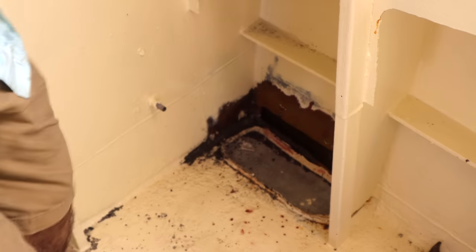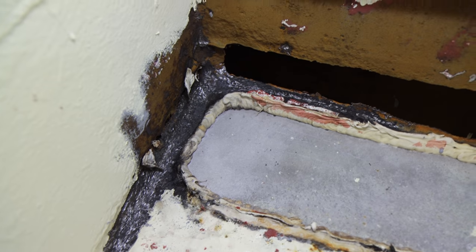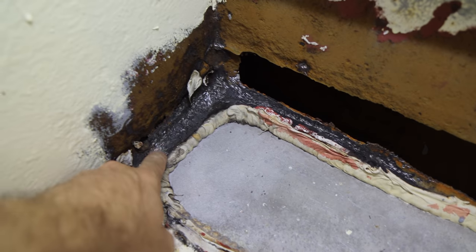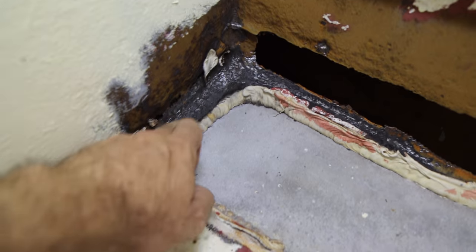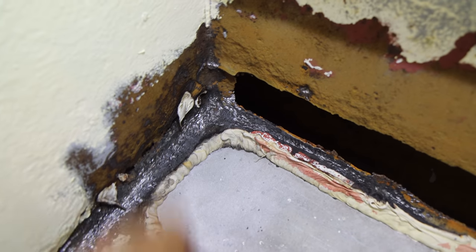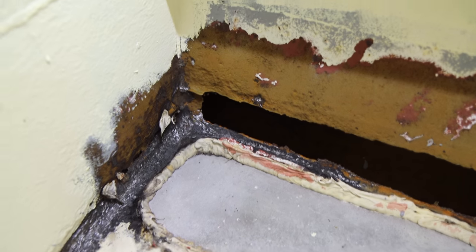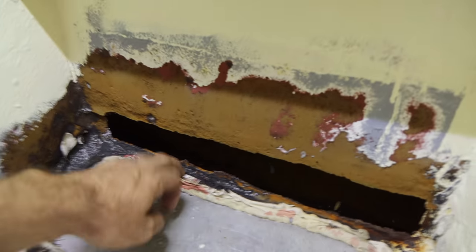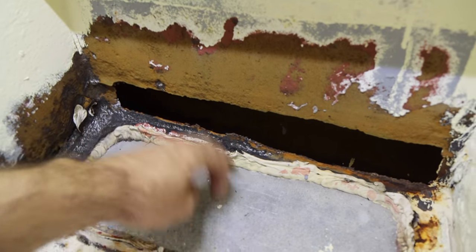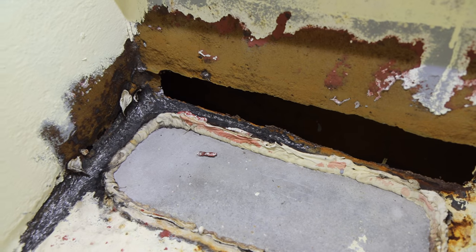I think that's it. Let's get a vacuum in. Right, that is basically bashed up, so it's not absolute perfect white metal or anything like that, but you can see because there's so many dent marks and bash marks and they're sort of shiny and silver, that we know that we've gone down. There's no more surface crap sitting on there that the flux core welding won't deal with. So I do have to probably scrape some of this sealant away, because obviously that's going to catch fire if I start welding that close.